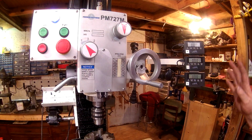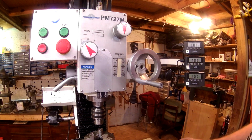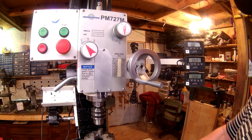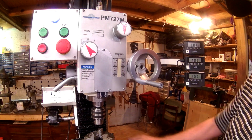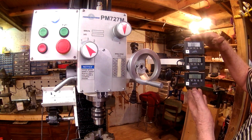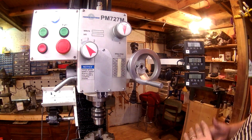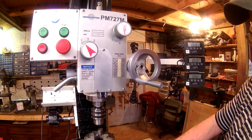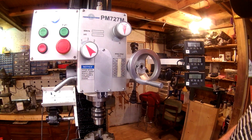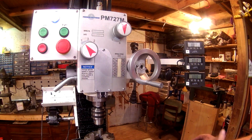Maybe in the next video, if not within the next couple weeks anyhow, I'll be installing Al Bassett's wireless controller board for the Touch DRO software package. What will happen is an Android tablet will mount over here. From what I understand, most any of the Android tablets will work. If you look up Touch DRO on the web, you can find the specifications.